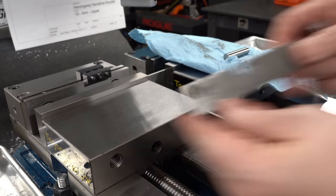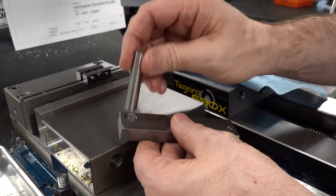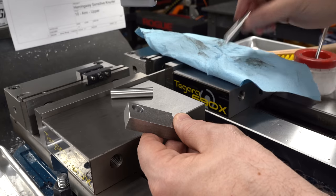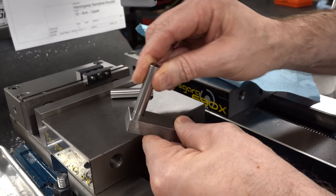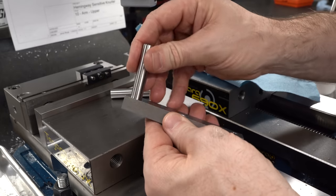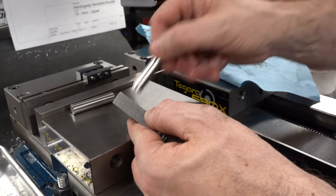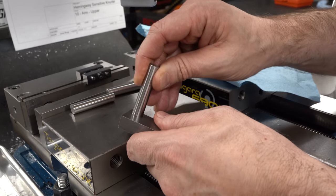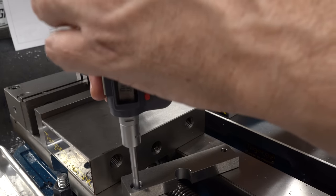Let's take another look at that 7/16 inch hole that I drilled to the nominal size. Drills always go a little bit oversized - how bad is it? A 0.437 fits tighter than expected. A 0.438 - which should be a half thou bigger than the hole is supposed to be - doesn't go through from one side, but goes at least halfway from the other side. So the hole isn't exactly straight. A 0.439 doesn't fit at all, so the actual hole size is somewhere a little bit over 0.438.